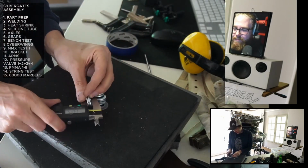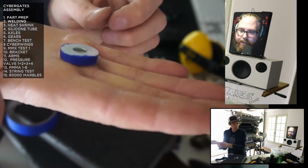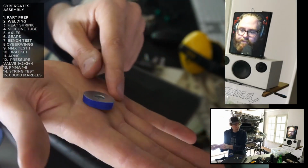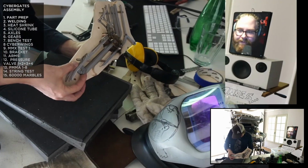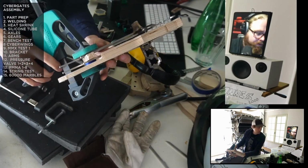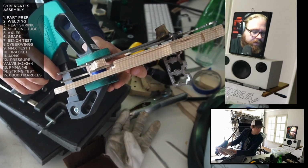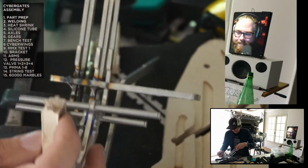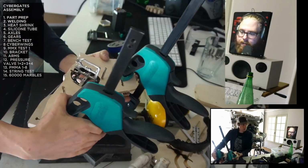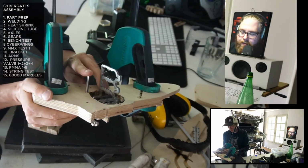3 M8 washers is 5.6. So I tape 3 washers together on the outside. If I tape it around, they get too thick. But this way it's easier to handle them. So here I'm putting the washers in. Wow, this lines up nice, Hannes. So now if you see it from this side, we have 10.5 between the big gap and then 5.5 with the washers. Okay, look how cool this is. Wow. This is gonna be so cool. Now it looks like this on the back side. You can see the shaft sticking up nicely there.